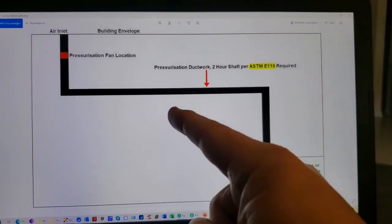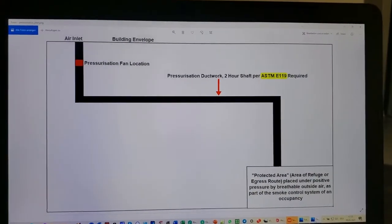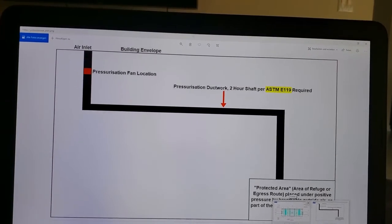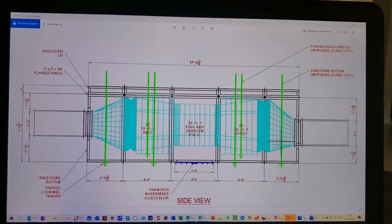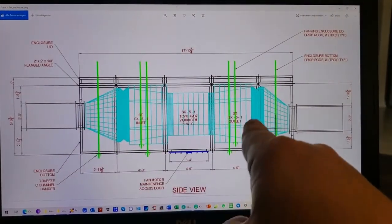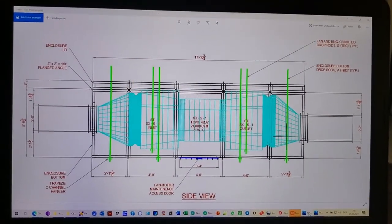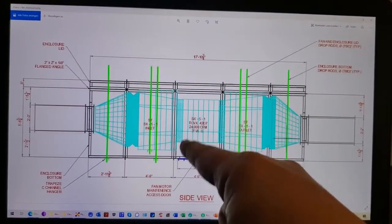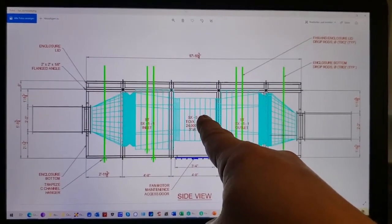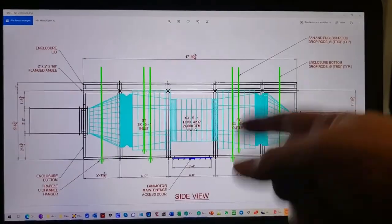If you're accepting as an alternate systems that are rated to ASTM E2816 or ISO 6944, then you're getting this. And by the way, the vendors, when it's a manufactured system, they know how much heat comes through. They see these on their shop floors, because these fans are delivered to the duct vendors and they mount them on the inside, and then the protection is on the outside.